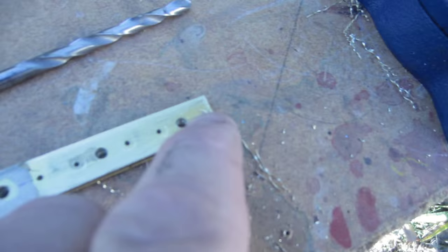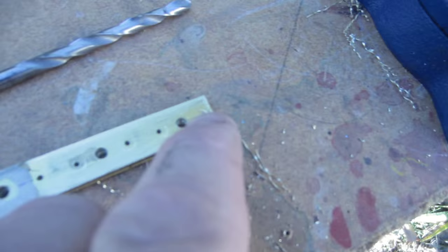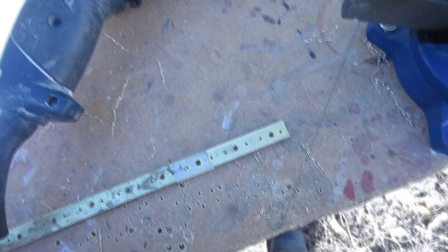I did the same thing again, did all the pilot holes, and I'm going to use this bigger one to do the bigger holes. The space between these two, like from the center screw out to the hole, should be 5/16ths also. These bigger holes are — let me see — this one's a 13/32nd. They don't have to be exact though; you just got to figure out what works for you.